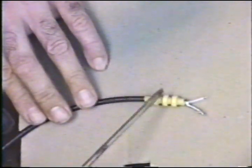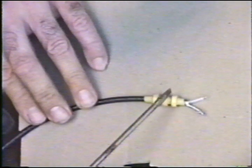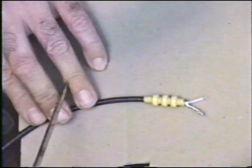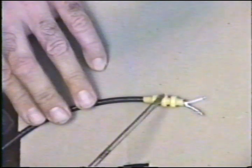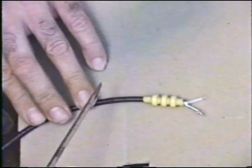We used heat shrink over top of these three. If you have super glue handy, super glue is a much simpler and easier way to install. The heat shrink is not really necessary. We use it simply because we didn't have super glue. And the same criterion applies. About a toroid width between each toroid. 3 is the maximum you'll ever need on this antenna.